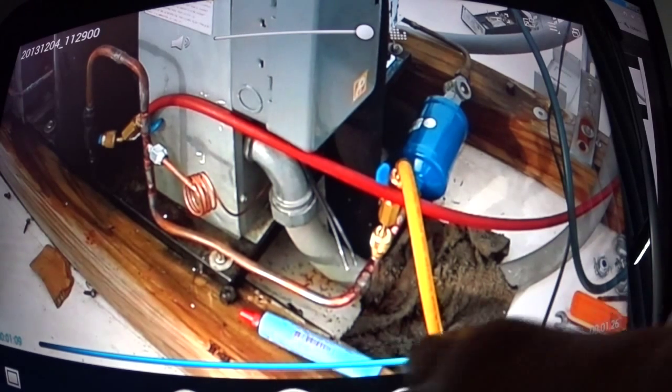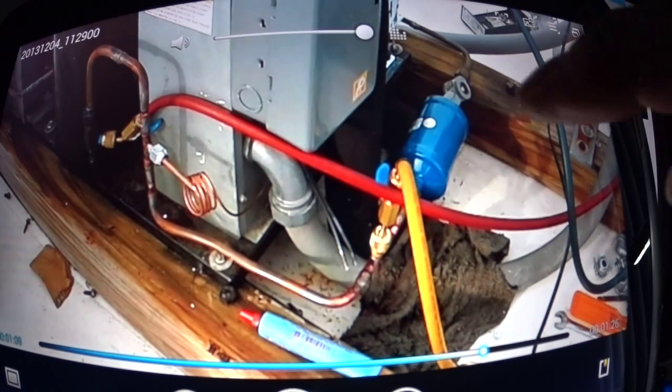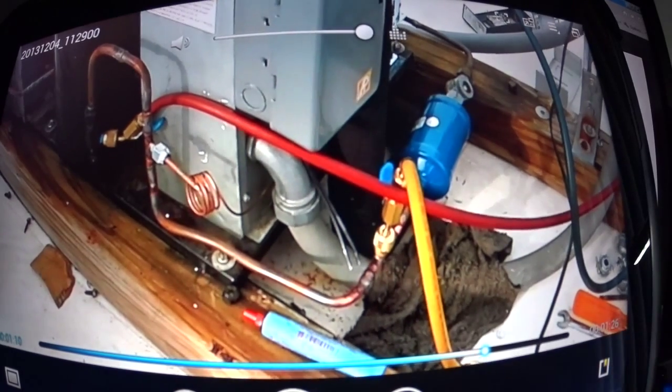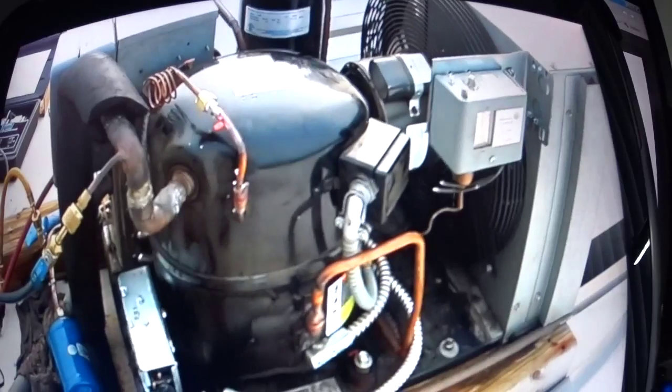Oh, and I do like to use this, blue leak lock. A lot of people use the Permatex. I just don't like that. I use it for the vacuum fittings, and if I have to change a gasket on a compressor, I'll smear it on that because it'll keep it lubricated, and so if I ever had to take it off again, that works good for that. But otherwise, any connections on my dryer filters or my brass fittings, I always use leak lock. I've used leak lock plus Teflon tape, the combination of the two, and never have a leak on it. It's always pretty solid. I've been using leak lock since, I don't know, the 70s, the 60s. It's been a long time. It used to smell like blue apples, or sweet apples.